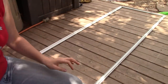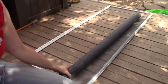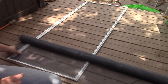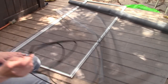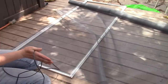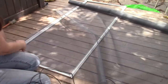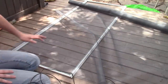The next thing is to stretch out your material. We bought this material for a different window so it's not the right length — as you can see it's just a little too short. So I'm going to run it the other way, which is fine because I needed some extra for my evap cooler anyway. Roll it out to the right length, get it nice and straight, and then put your screen spline in. It's important that you start from one long side and go toward the other sides, then do the last side opposite from where you started, so you keep the tension correct and avoid any bubbles or wiggles.